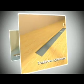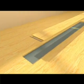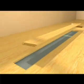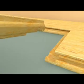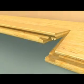9. Trouble-free replacement. Where one panel in the middle area is broken, Tap&Go offers you an easier way to replace it with a new one. After fetching out the broken one with special equipment, take a new panel, then you just need to saw off the short side low hook and install it conversely. The remaining 3 sides of the hook can also lock the floor with others firmly.